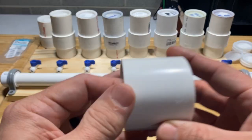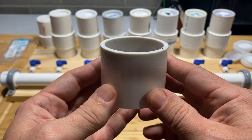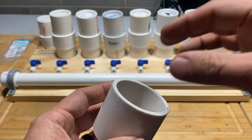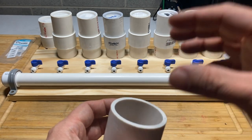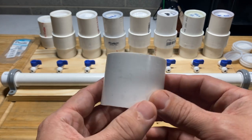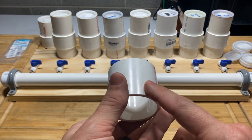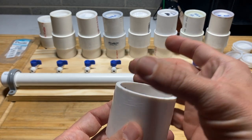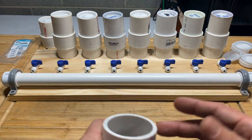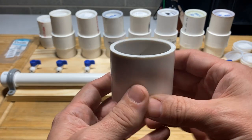I bought a two-foot piece of two-inch PVC. Each one of these bases - the bottom piece where the air will go in - is two inches tall. In the previous design I had a three-inch piece, then a coupler, then another piece on top. A buddy of mine who was building one asked why the extra coupler. The reason I did it originally was wrong - I thought the coupler unit was going to come off and store the paint. That wasn't the case. Because the filter goes between the base piece and the coupler, you don't need an extra coupler on the bottom.